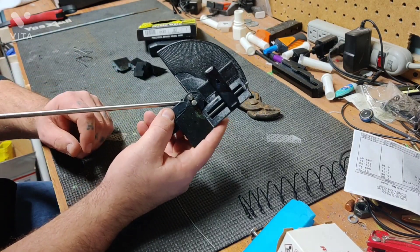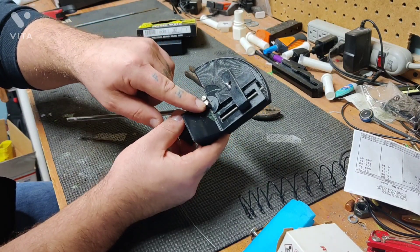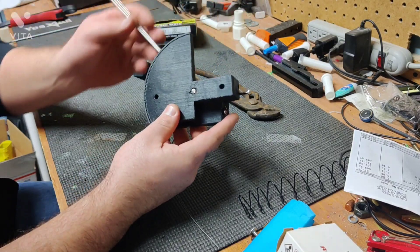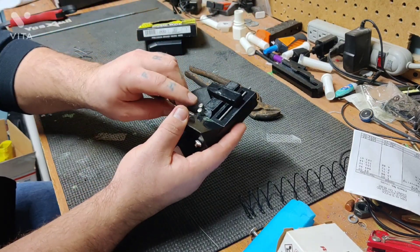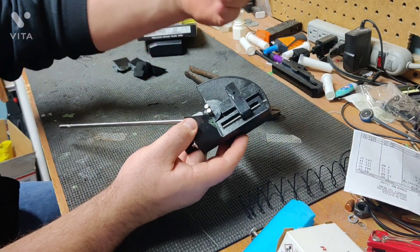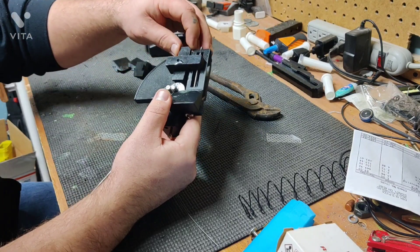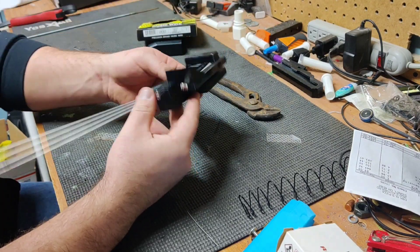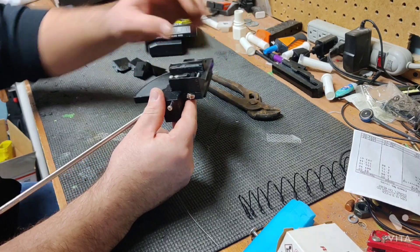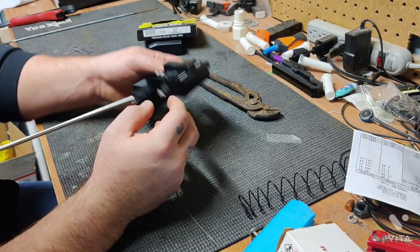As far as the build goes, it's pretty simple. These are both 6mm rods — one goes straight through for the pivot, the other stops inside the block to catch your wire and bend it around. There's an adjustable stop on here; I don't have it set up yet. You would put a square nut inside so you can turn it and get it where you want it, and then a little screw on the back to hold your ramp in place.